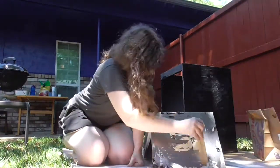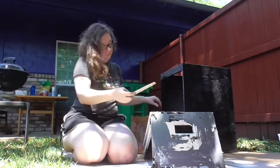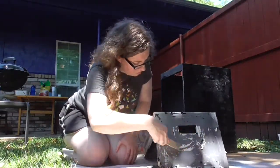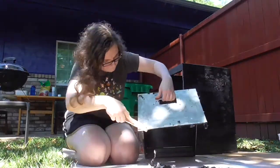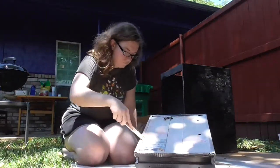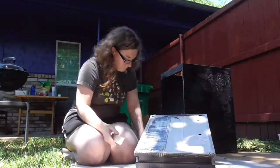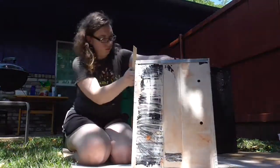After putting the new citrus stripper on the body, I went ahead and started working on the actual drawers of the filing cabinet. They weren't too bad. I noticed there was paint on the bottom for some reason. You can actually see here the way the citrus stripper works — it turns white and kind of cloudy after a while, or at least if it gets dry, and I think that's why they tell you not to let it dry, because it doesn't work as effectively.